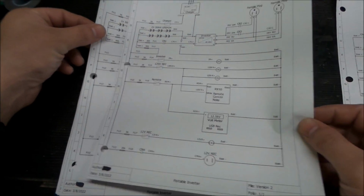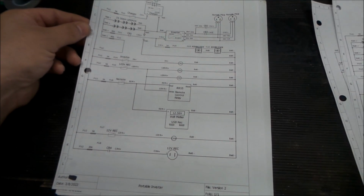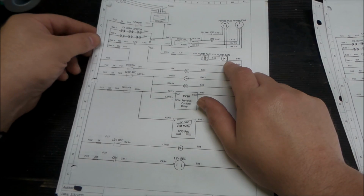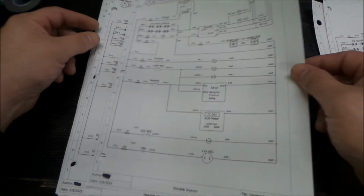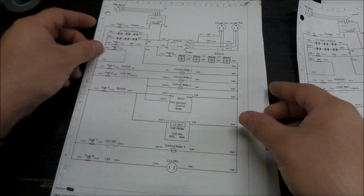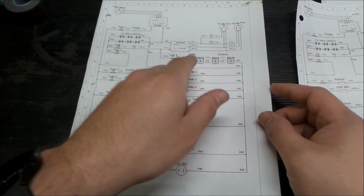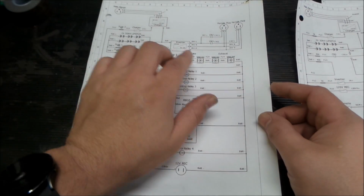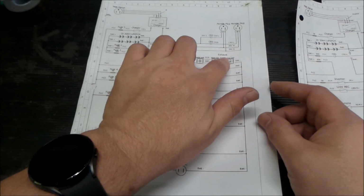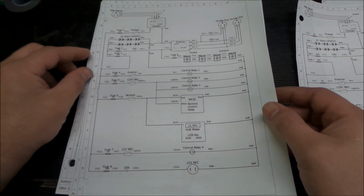So we did that. Then we realized that we needed to add fans for the inverter to help keep it cool. Added another fuse there. There's our fans. Started with 2 fans. Then at this point, we were looking at it a little bit closer, and we figured we could fit 4 fans in, 2 on each side, and that would equal or exceed the larger fan on the inverter. The point was to actually exceed it. The inverter had a slightly bigger fan, so these force additional air through that's not going through the inverter.